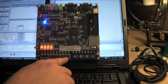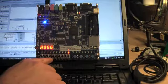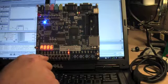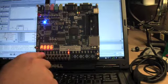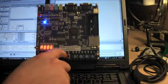So then if we change our control signals to 0, 1, now switch 6 no longer has any control over the output, and instead it is bit 1, or switch 7 in this case, that has control over the output. None of the other switches have any impact.